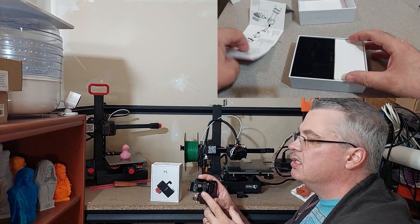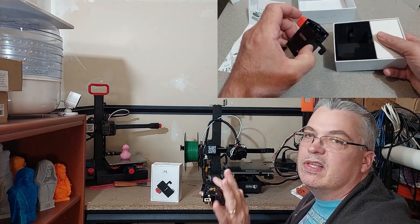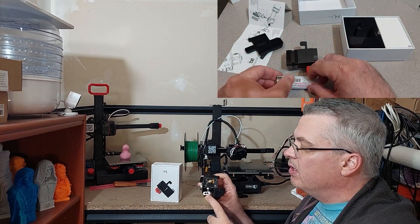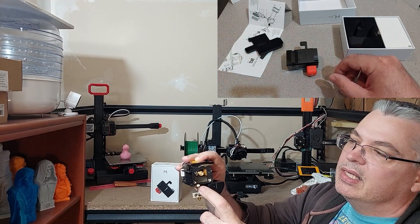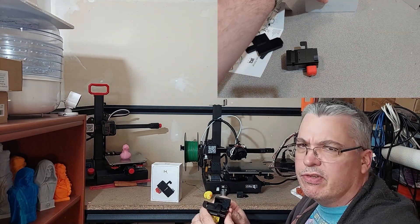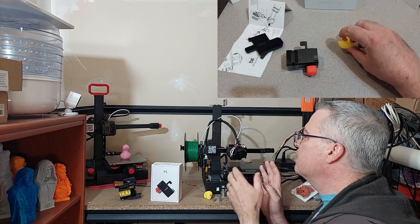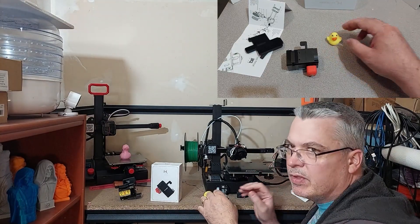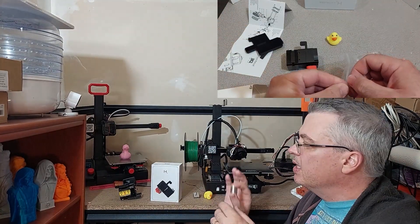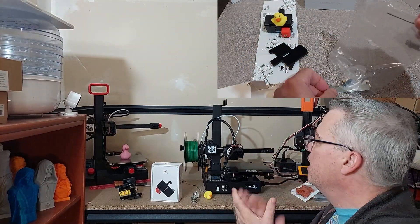The reason why I'm doing this is the original extruder is almost twice as heavy. If this extruder works for you, great — it was working great for me. But I noticed it's actually just a throat with no heat sink, and I had it clog on me a few times. So I figured I might as well upgrade to a lighter direct drive extruder and try to get a lot more speed out of it.